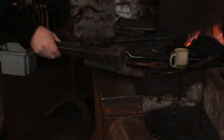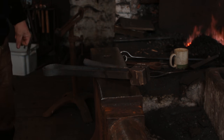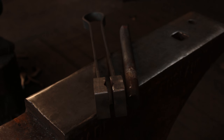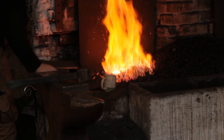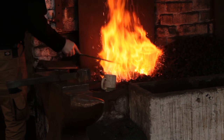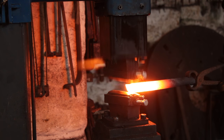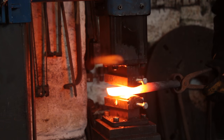I'm using wrought iron — a section of inch-and-1/8 round — and I will take it to 3/8 round, partly with a spring swage I made for a different job. But before I use the spring swage, I will rough out the bar to the correct section just using the drawing dies on the power hammer.